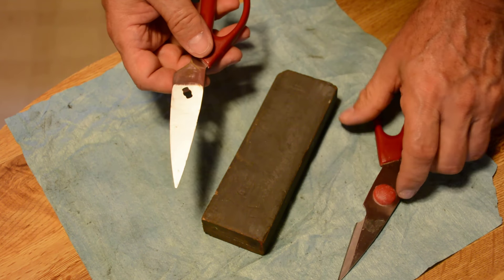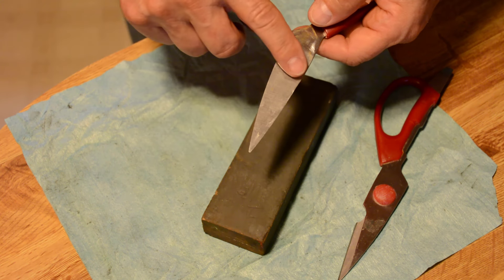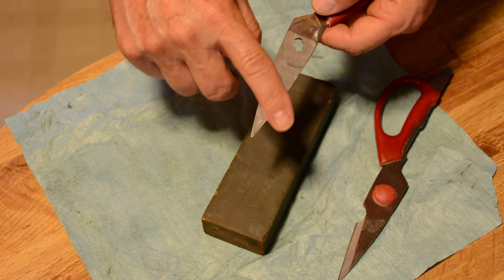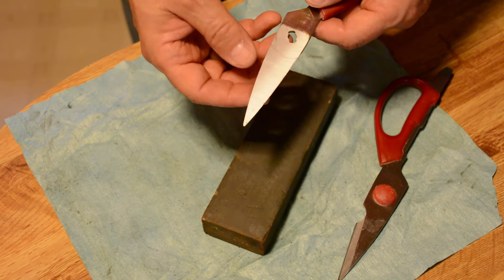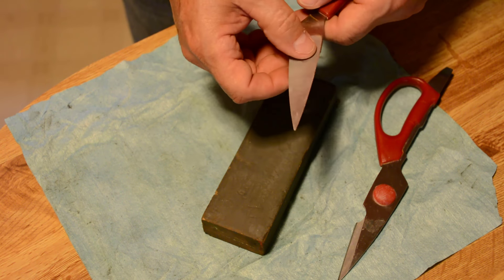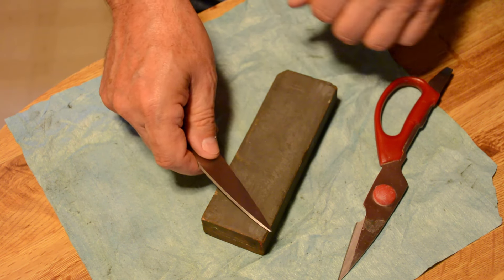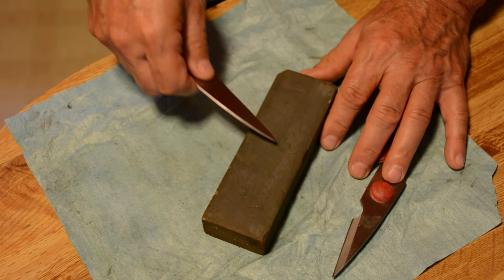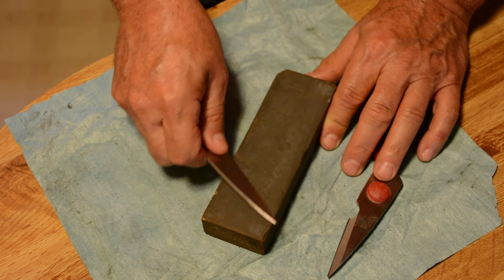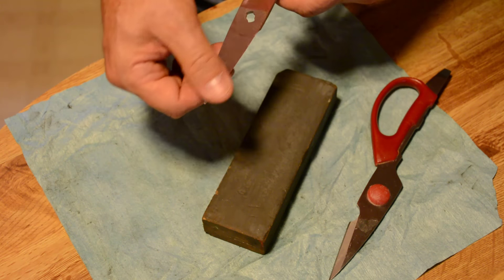You do both shears that way. When you get through, feel the back edge by rubbing your finger across, but away from the shearing edge. Very lightly — don't put any pressure here — but you're feeling to see if there's a burr on there. Sometimes when you're sharpening, a little bit of the metal will get rolled over to the backside, and that makes a burr. You don't want that. If you feel a burr on the backside, take your shear again, put it on your stone, and just pull it straight towards you — don't do the rotating method. You do that a few times and usually that burr will go away. And that's how you get the edge sharp.